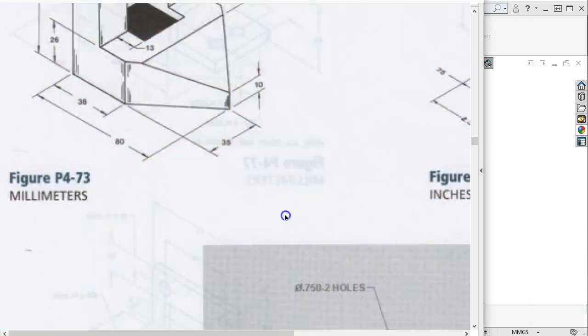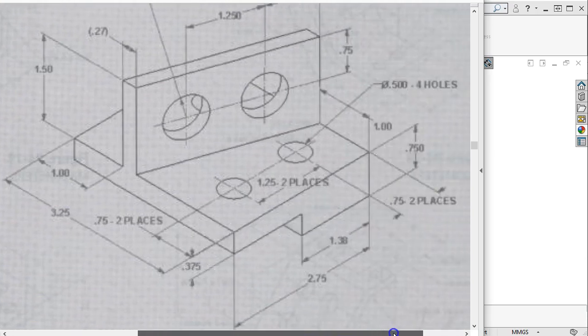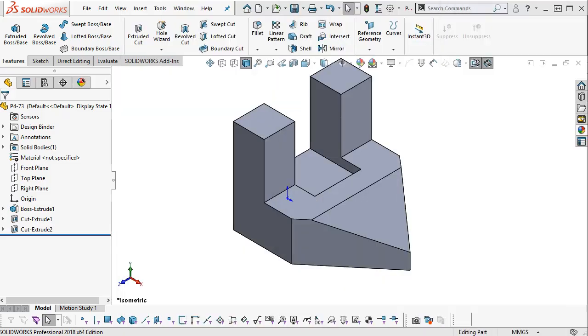Alright, fly this back in. Alright, zoomed up a little bit on our geometry, so we're in inches. We have the step, probably start with it. We'll pick up the geometry, making it flush, and then to an inch. 0.75 two places. Isn't really showing anything. Yeah, it does show a little half moon there on the backside. So 1/2 inch 4 holes. There's the confirmation.